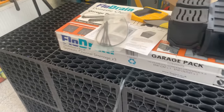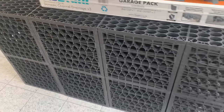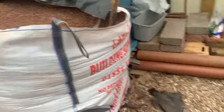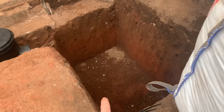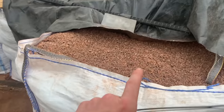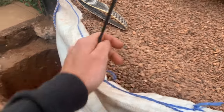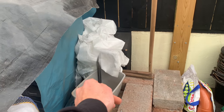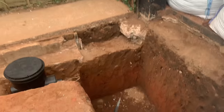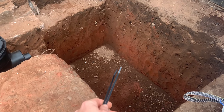That's all my soak away crates. Looking through the manual, making sure I've got all of the crates the right way round, cable tied together, make sure they're all solid so it's all one compact unit. I've got a load of pea gravel to start with, and a load of chipping — I'm going to scoop in all of this chipping through here, chuck a load down into the hole as well, probably put a good foot of this underneath the bottom of the hole to start. After I've got all the gravel in, I'm going to lay that sheet in the ground so it covers all the way up over, then I'll put the crates in, then I'll wrap the sheet up. Let's just crack on and see how we get on — one job at a time.